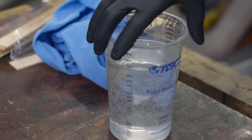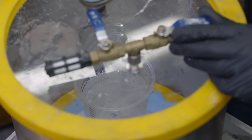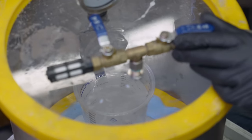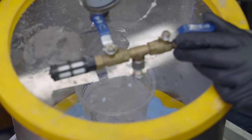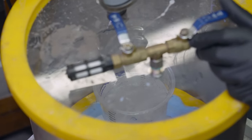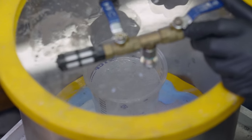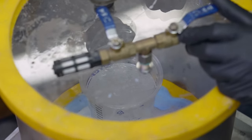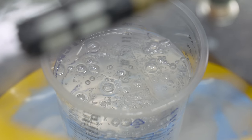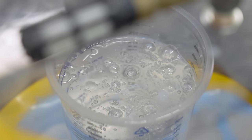So tossing that, I'm gonna put this in here for evacuation. Very reluctant to give up its air. So unlike normal casting resin, which bubbles up, oh, there it goes, here it comes. It's not nearly expanding as much in volume. There we go. We'll just make sure it's not gonna overflow the extents of the cup, and we'll let it sit there and think about what it wants to do for a while.